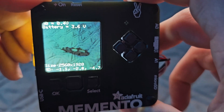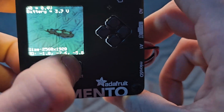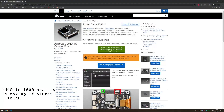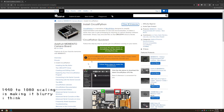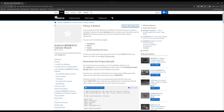I did take a photo here, but I think in flashing CircuitPython to it, it wiped the SD card. I headed on over to the Adafruit site and grabbed the UF2 file for this board — just follow the green button there. The blue button I didn't have to do; it was present when I installed it. Grab this UF2 file, and then you'll also want to get to this page and download that project bundle there.